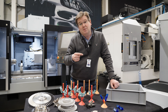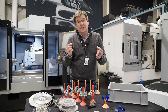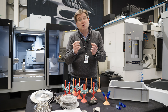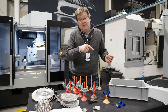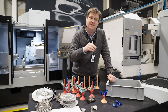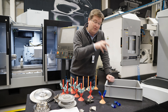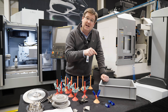One of the things that cropped up during some dumbbell testing — some mechanical strength testing of the superalloys we use to make the blades — is that we found a discrepancy in the performance and mechanical properties. We put that through our full non-destructive testing program and we've now managed to identify the source of that issue, which demonstrates not only that we've got the process under control but also that our non-destructive testing methods work.